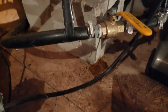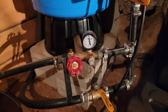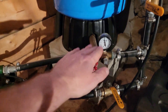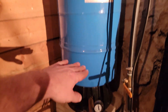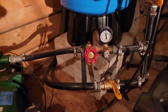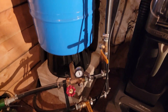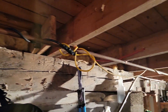The last one actually split in half and just shot out. I'm not sure if I'm going to replace the whole tee or just the plug. From my experience, I'm likely not going to be able to get either one of these plugs out — they're going to crack off and break. So I've already gone ahead and bought a whole brand new tee. It's actually not super simple to get the tee out of the pressure tank either; you've got to be pretty gentle. Anyway, all of this has to be replaced.